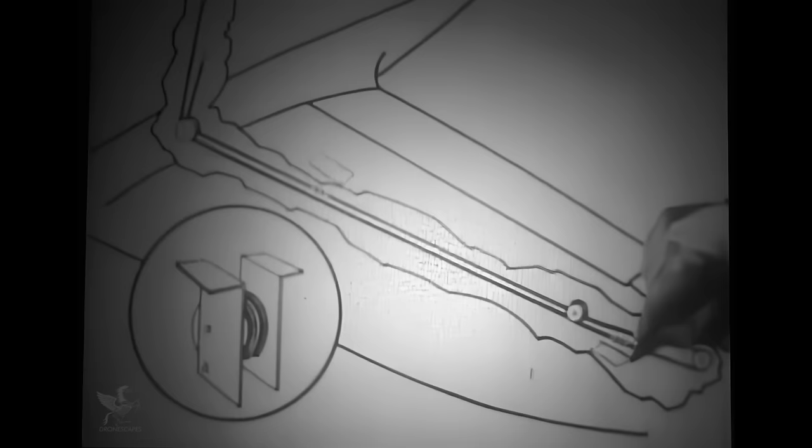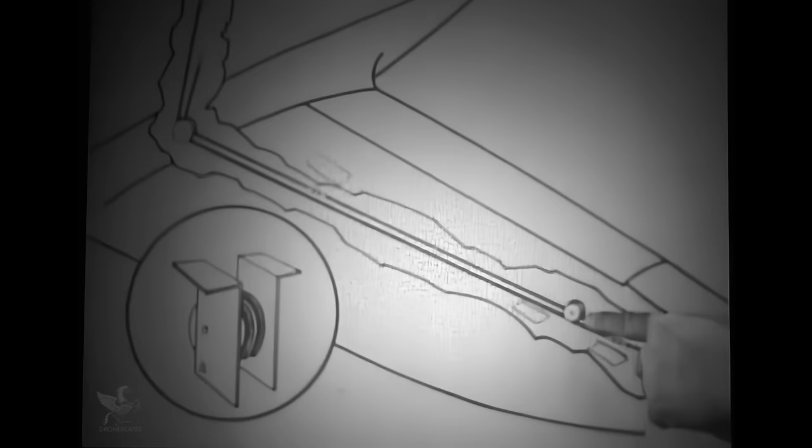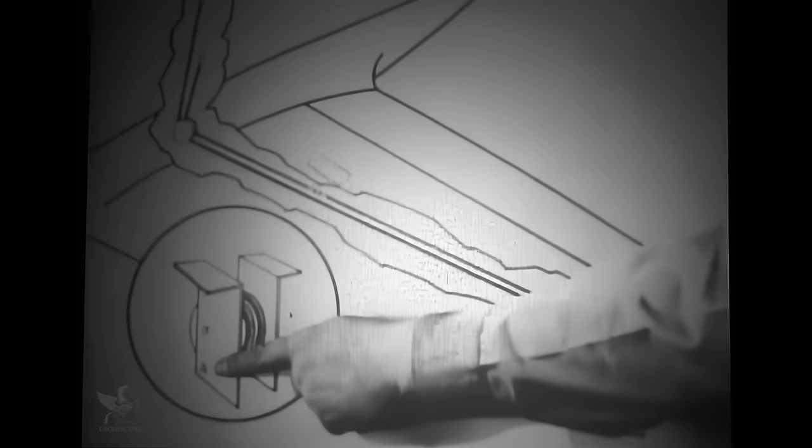The long cable, pulled through by tracer wire, is connected to the chain by reaching up through this access hole. At this opening, reach in and install the pulley guard with a clevis pin and cotter pin provided. Here is a closer view of the pulley guard, showing where the clevis pin is inserted.